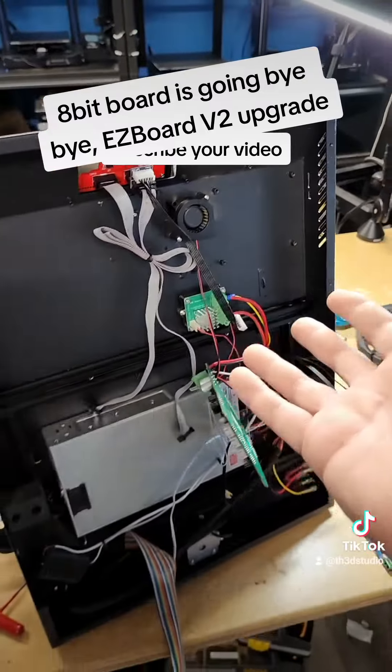So I haven't decided yet, but I think we're either going to put ends on this — cut this off and figure out what wires are what — or what Matt suggested, which I kind of like better, is just getting rid of this breakout board completely and running new wires for the motors, end stops, heaters, etc., and just come through the hole here.